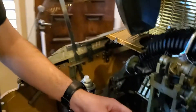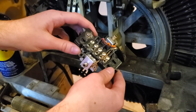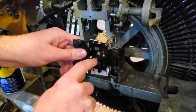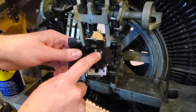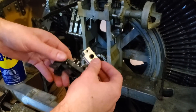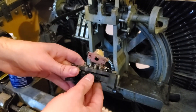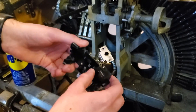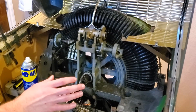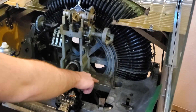I've been cleaning up this — it's called the carriage — and what it does is find the song you selected. It has these switches on the bottom that are spring-loaded and supposed to move, but one of them is stuck and frozen. I already took off these little solenoids, and I'm going to have to unsolder it so I can get it freed up and clean the inside so the contacts are good. I took this tone arm assembly off, washed it with degreaser, and got all the dirt off.